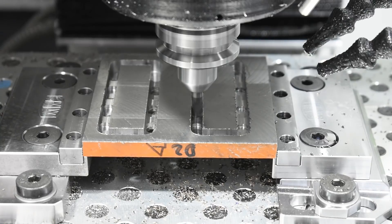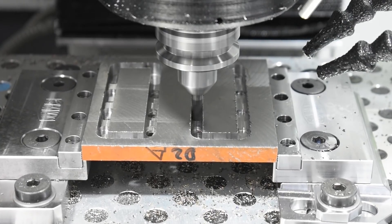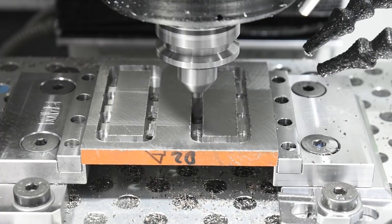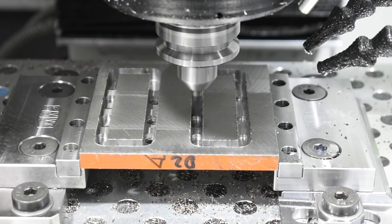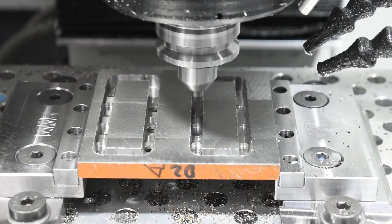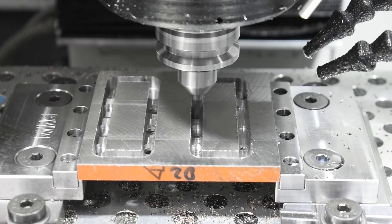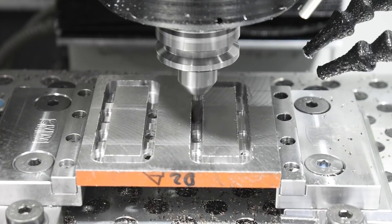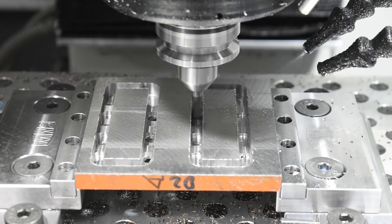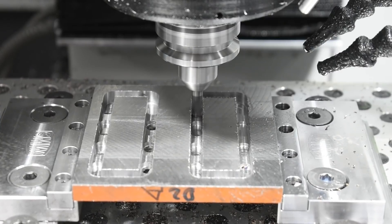Now let's watch the slotted part that didn't have the pre-drilled holes. We'll use the same feeds and speeds as before, and you can definitely hear a load increase during the plunge on the tabs. Some of the chips did start to turn a little more vibrant color, indicating either more heat in the cut or there might have been some tool wear. This could be due to the conservative chip load but I didn't run enough tests to find out. I did notice some other differences though and I'll talk about that in the conclusion.